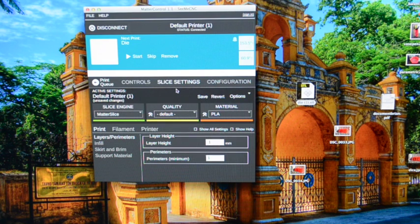I'll click on Slice Settings and configure what I want for my dice. For layer height, I want to print these fairly quickly and the details look fine even at a higher layer height. I actually like how at higher layer heights the PLA has a kind of gloss to it that looks cool, whereas printing really thin loses that gloss and feels more generic. If you wanted to paint it and didn't want visible lines, you could try a really low millimeter height.